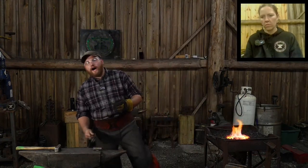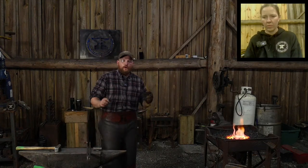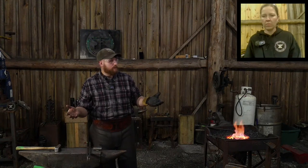Okay. So the reason why I have chosen to do a wrapped eye on the wrought iron, and the historical precedence of why most wrought iron axes had wrapped eyes, is for two separate points. The first is that it's a lot easier to take a strap of material and make an eye and just weld it to a bit. Again, welding was like water to blacksmiths back in the day. They did it all the time. They had no arc welders, so they got really good at doing forge welds, right? And their materials were really conducive to making forge welded items. Wrought iron loves to be welded to itself through the forging process. So that's number one. It's easier to take a strap of iron, spin it around something, and attach it, and then make a blade out of it, than it is to take a big chunk and punch it and spend a lot of labor drifting a hole through it.